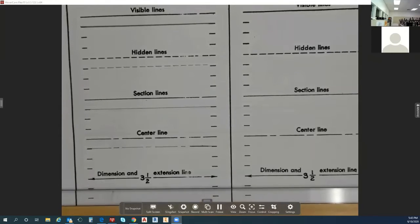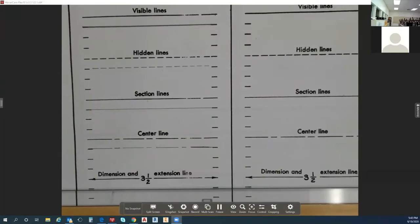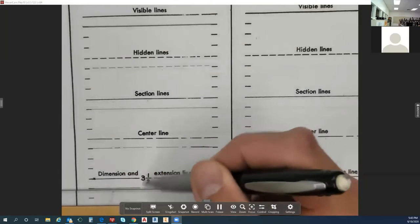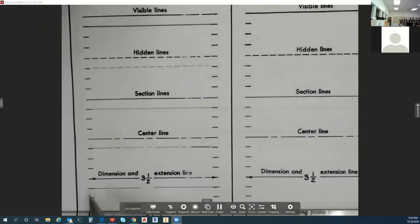Dimension lines. Dimension lines are thin lines, and you've got a little arrow on the end. When you start writing numbers in here it's all going to bunch up together, so I'm not going to have you write the numbers tonight — we'll do that when we do our drawings. But you do need to leave a little break in the middle for your dimension to fit in there. In this case it's three and a half inches. Dimension lines have a little arrow on the end, so carefully on this assignment we will sketch that arrow in. You will learn how to do a proper arrow later — that's in unit seven, about a month from now.